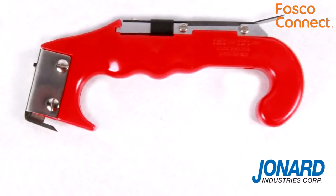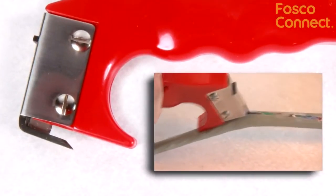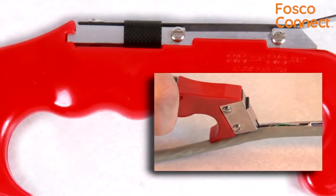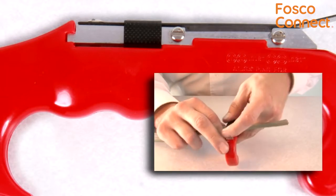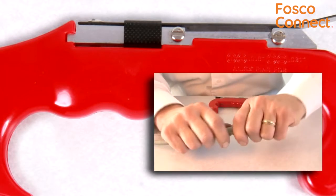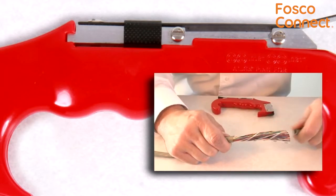The tool is designed with two unique blades. The one located at the tip of the tool is for stripping and slitting cable, and the blade situated mid-span on the handle is for cable ringing. The ring feature is adjustable for either 18-thousandths or 31-thousandths thick plastic, rubber, or fabric insulation.